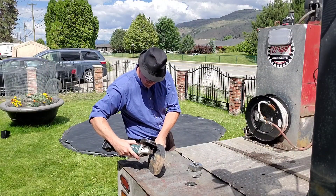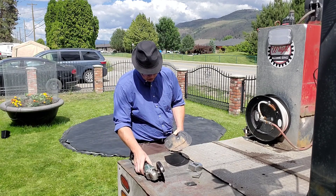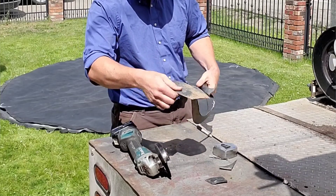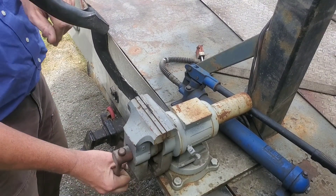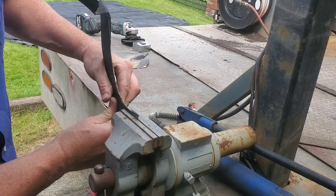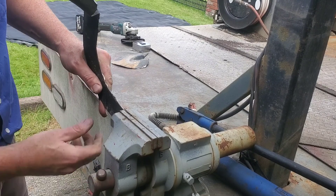The reason I chose a shovel as the material is because it's a higher grade steel. You've probably noticed you've never been able to bend a shovel — they tend to just crack. This is because it's a similar steel, not the same but similar, to spring steel. As you can see here, as I'm trying to bend it, it always wants to spring back.